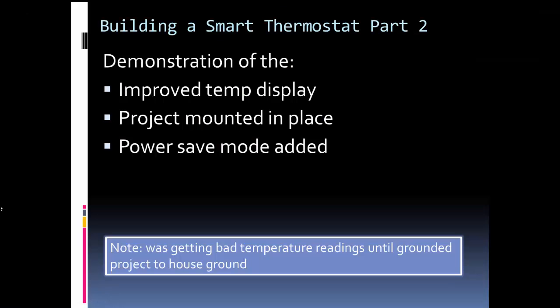One thing to note: when I hooked everything up I noticed my temperature value wasn't changing much, even after running the AC for 10 or 15 minutes. This was a problem I didn't see in prototype form. When hooked up to the AC circuits — even though I have the switches isolated using opto-isolators — there was still AC interference getting into my DC. I grounded the unit to the ground connection of my condo and the problem went away, though I don't think I showed that in the diagram.